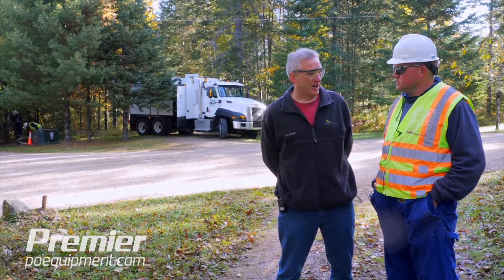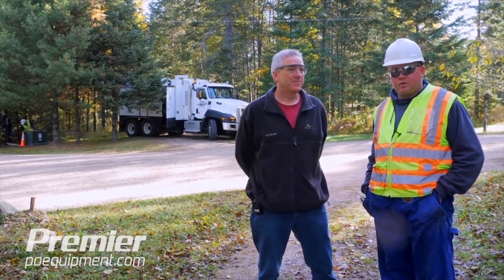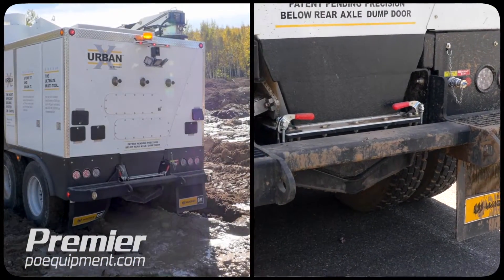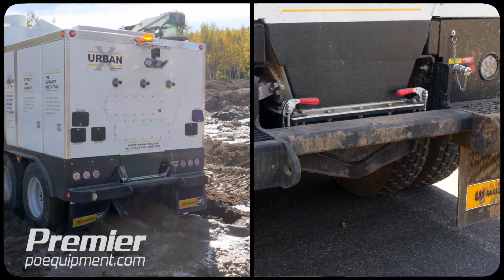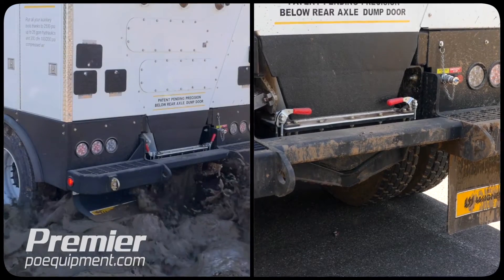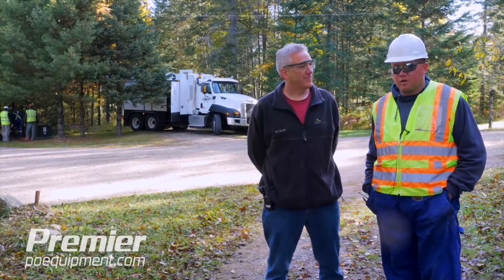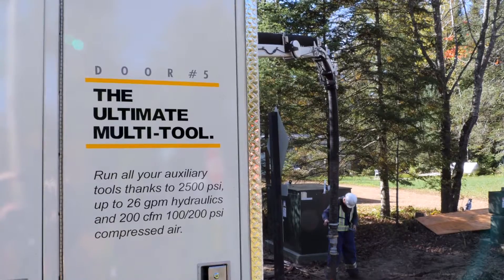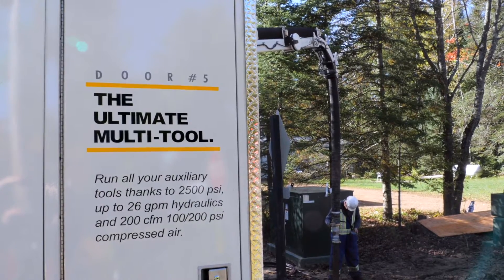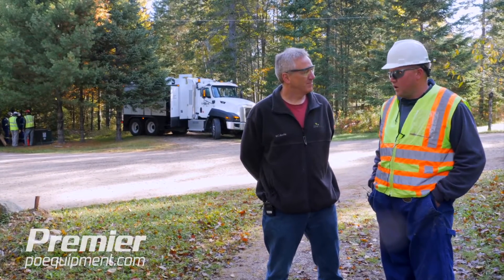The nice advantage of the under-axle dump with the air-water combination is you can dig with air, keep your spoils dry, and open up the rear axle dump over the hole you were digging — putting your spoils back without having to bring back a whole bunch of clean fill. Some regulations require clean fill over the utility, but then you can reuse what you have in the truck. With this machine, it's got the hydraulic power to run a core drill or a hydraulic saw. You can run the auxiliary hydraulics, the air compressor, the blower, and the water pump all at the same time.